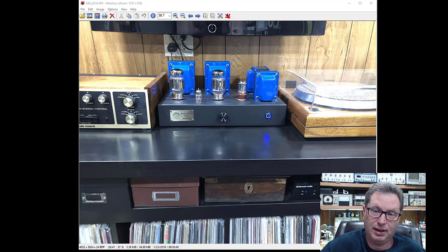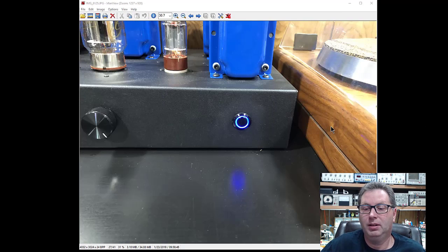I personally cannot. If you're one of those individuals that can and you wanted to fix that, one thing you could do is take the 6.3 volts feeding this, and you could use a little 5 volt regulator, an LM series, and feed it via that 6.3 volts, and then feed 5 volts DC into this thing. It would be a simple little wire up to include that instead. But all in all, I think it looks really good. You can also see here what it looks like up close. I am extremely happy with it.